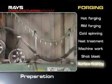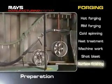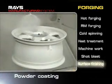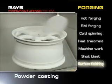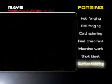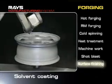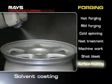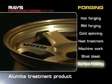During finishing surface treatments, chromate films are first applied on the surface to protect the aluminum from corrosion. Fine coating materials with a diameter of one hundred microns are blow coated to improve smoothness. Then the wheels are spray coated. Wheels are colored in line with their designs or clear coated to protect their surfaces. Wheels may also be alumite treated to improve their metallic luster.